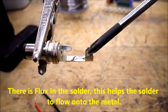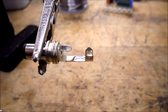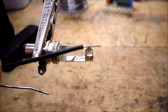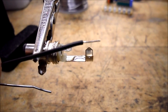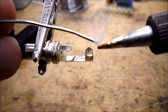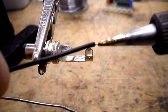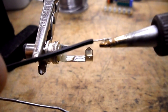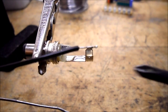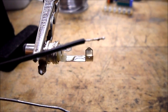You can see I've put a little bit of solder in there. Now the next step is to take the wires from the battery clip — you also want to make sure that those are tinned as well. Pick up a little bit of solder on your tip and then make sure that you get some of that solder on the leads. Don't leave the tip on the lead for too long because the wire will heat up and the insulation will slowly shrink backwards.